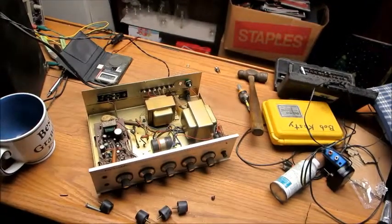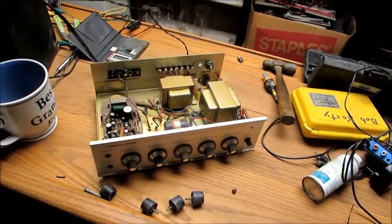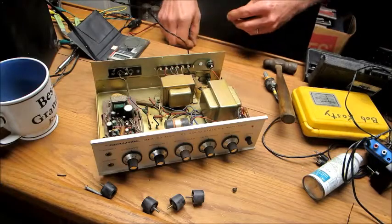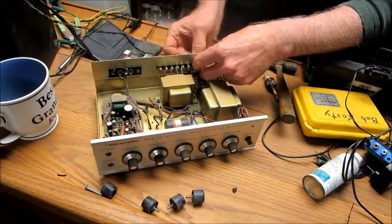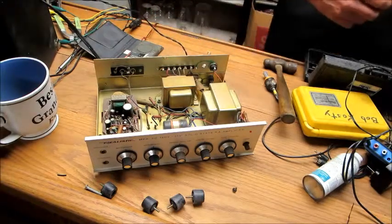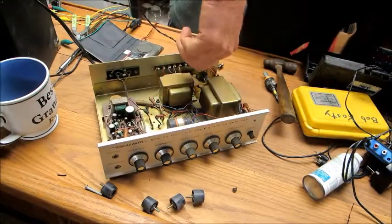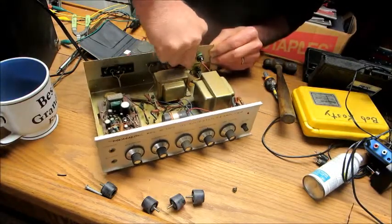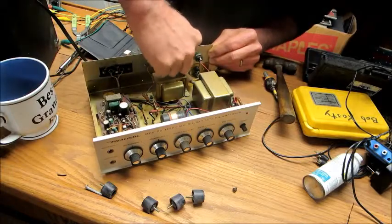All right. So as I'm working on this, I'll turn you on and off so you can see. I'm recording with my little elf camera today because that's what I've got right here handy. So, power connector. That's got a burr on it. So we need to get something to deburr that. I've got a pair of little side cutters here. Just knock those burrs off, which actually will help increase the ground bite in case there's any coatings on it.